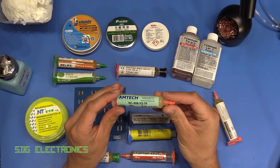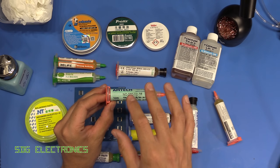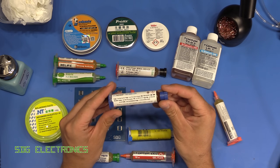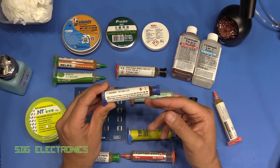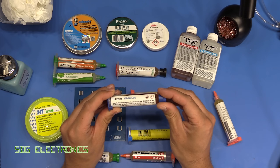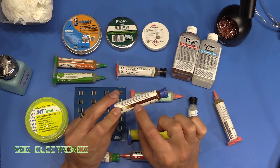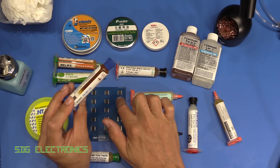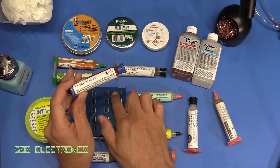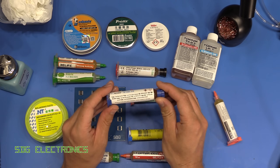The Amtec flux was also very good — it was quite thin in its viscosity but gave really good results. The only downside is it's the most expensive flux on the table. The Kester flux was also very good — the results were really good and it dispensed really well, giving a really nice bead of flux across all of the pins with absolutely outstanding flowing. The main problem with this is that because it's got such a high rosin content — you can tell by the colour — it's really difficult to remove from the PCB and from the IC. It ended up with some hard deposits on the pins, which is fine if you've cleaned off the majority of it, but just a little bit difficult to remove.